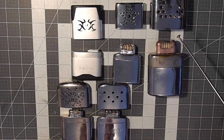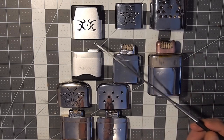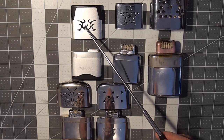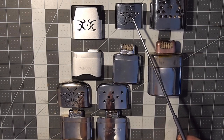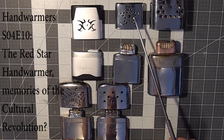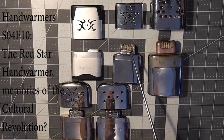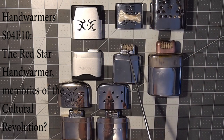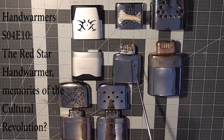So what I did was put the three that I can get up to 165°F, and which also tend to operate more reliably, along this top row. We have the S Boston on the left, then what I've named the Red Star hand warmer from China. You'll have to look back at our previous series about how I did a modification to this inexpensive hand warmer — basically adding a carbon felt strip to the top of the reservoir, taking out the very strange-looking catalyst head and replacing it with proper catalyst. Lo and behold, it started working up to 165°F and will last in your pocket for pretty much a full day.